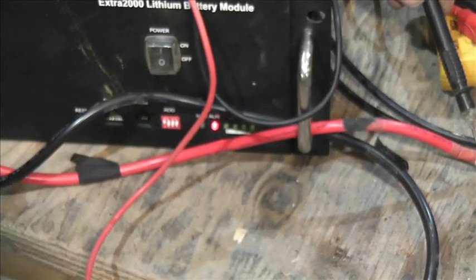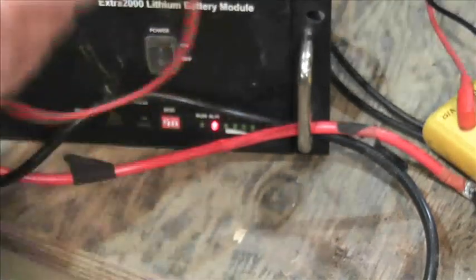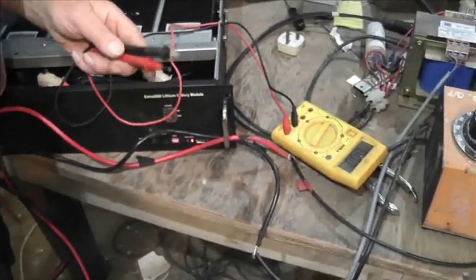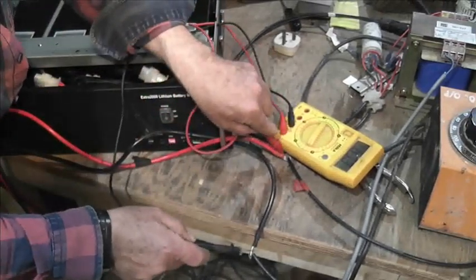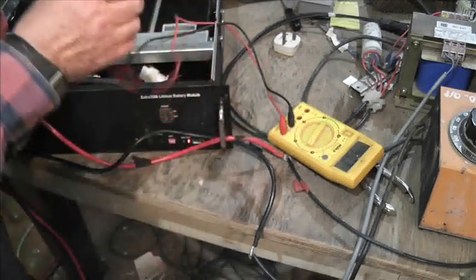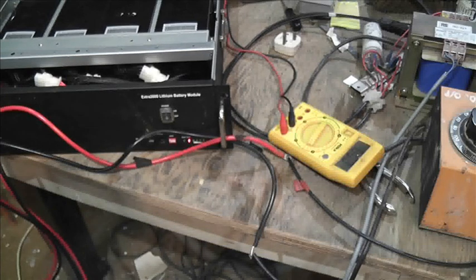Using the isolated DC variable power supply, I connect the positive and negative and set the voltage. 150 volts is way too much — let's set it to 49 volts. Connect it to the unit, switch it on, press reset a few times both on and off. The alarm is still present, but the output now reads 47.5 volts. I'm thinking we've definitely got a duff cell.